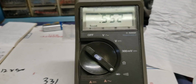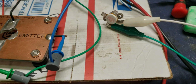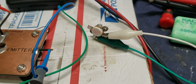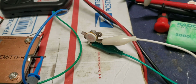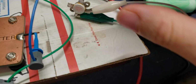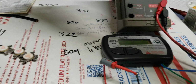I may actually just cut this little piece off of this video and put that in there. And of course, there are other checks you can do. You can take this further. So I may just say this right here is the simplex, the most simple way to check. This is all we used to use, okay? You can go a lot further to check other things with the multimeter, with the ohm reading. But this is what counts to let you know that the transistors, diodes are working. If they're working, the transistor is probably 95+%, meaning it's good to go.